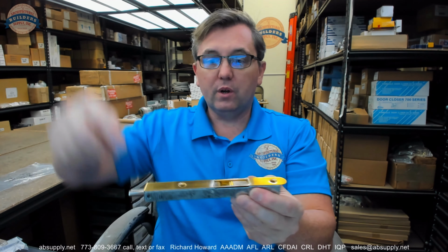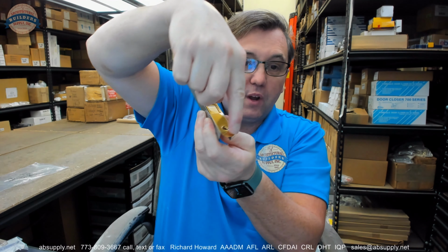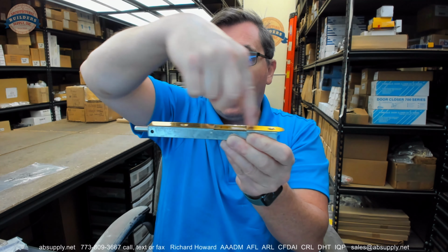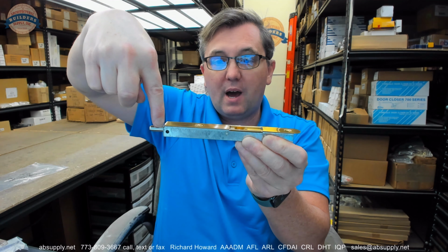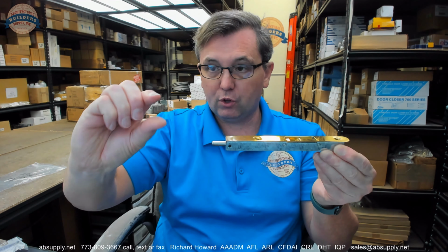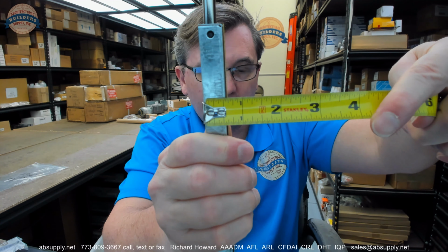Yeah, 6 5/8 is where you would come. At 6 5/8 is where you would plunge down to your center, and you would create that radiused end, and then you would route a single route out the end of your door through the top or bottom rail. You're finished. Obviously, you'll need to make multiple passes with your plunge router, increasingly deeper till you get to the proper depth, which would be about 5/8.